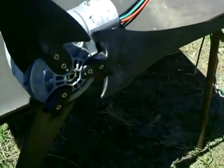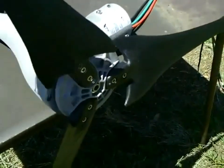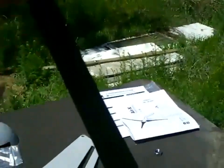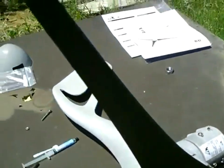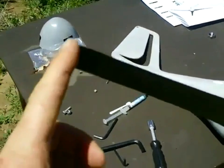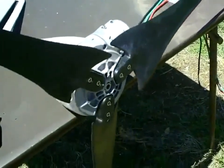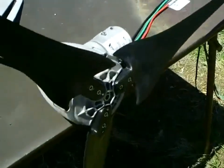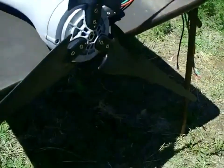The installation was very basic — install the blades exactly the way the directions say. These blades are made of a polymer composition, very strong. They're also very flexible so they can flex in the wind but they won't break. They seem kind of thin, but that's actually the design — they're tested in wind chambers. They're made to cut into the wind to get the maximum speed out of even small winds. Some turbines might come with more blades, but this is a three-blade turbine. Three-blade turbines are very common, and the research shows a three-blade turbine will still get the most out of the wind.